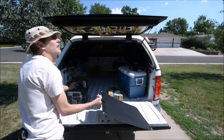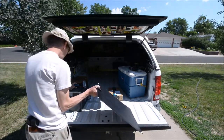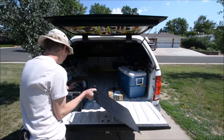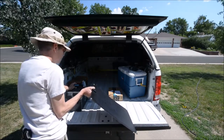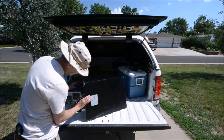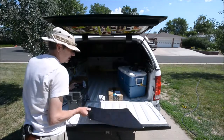I'm just going to angle it up towards the sun, and it jumped up to 1.5 amps, and it's charging at 15 watts. Maybe this is a 15 watt panel. I'm going to put a note in the description. It says it's a 30 watt panel.